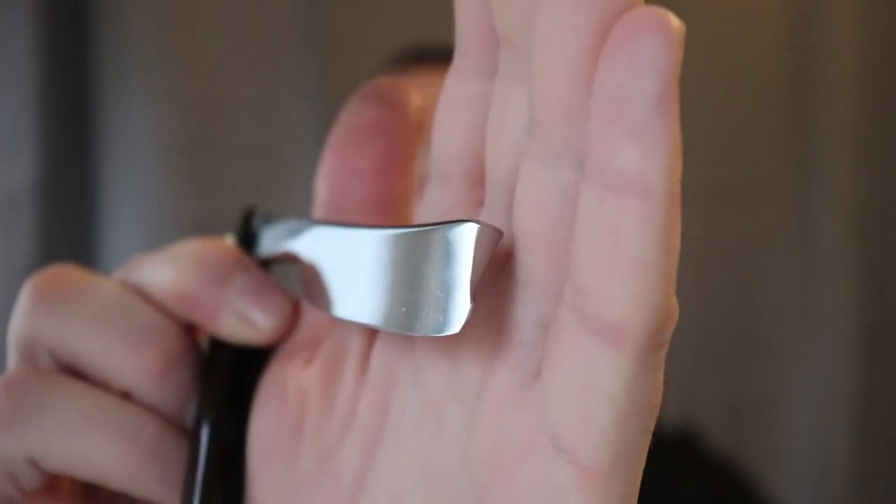I honed it on the Nakayama with a full Nagura progression. I changed my Nagura stones again — mixed in some softer ones — and I used the new Tomo Nagura that I haven't used before with the Nakayama. It seems really good. When I was doing the bevel set and checking if it pops arm hairs, it was really smooth — not catching the skin — so I think this is some of that special steel.